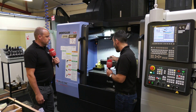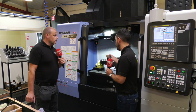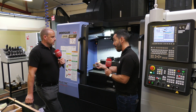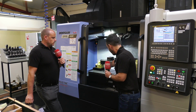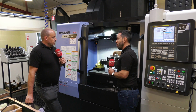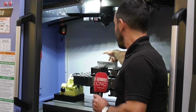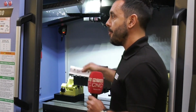And you can do any angles as well, if it was a 45-degree angle, whatever the case may be. So that's the first operation, and you've hit 3 faces. You've achieved adjacent side milling. Then for your second op, where you load at the other end of your spindle, that component gets presented to the spindle in that orientation, and then you do that face there and your other 2 faces by tilting there and there. If that makes sense.